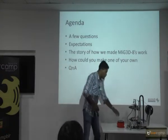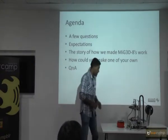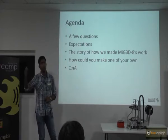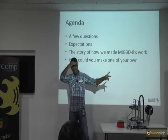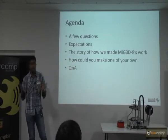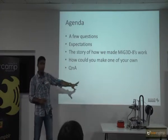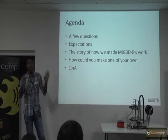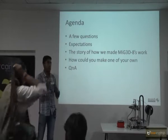How this whole thing works: you have three axes — X, Y, Z — it is simply an XY table — and you have Arduino which controls the whole thing, all driven by a number of pulses. The stepper motor has a finite distance it moves based on the number of pulses you give it. The Marlin firmware works by having a limit switch at one end of each axis — the firmware starts counting pulses from the time it moves to one end of the axis, and then it knows at any point where it is. You have X, Y, Z axes all controlled by stepper motors, and you have the extruder which is the fourth axis, bringing down the plastic based on how much quantity of plastic is needed.